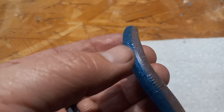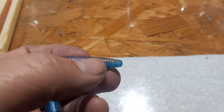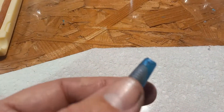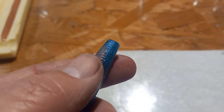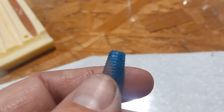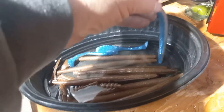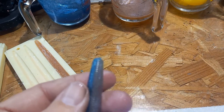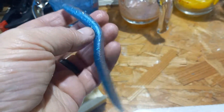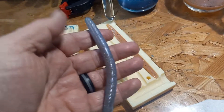This is without a laminating block, and I think this is far simpler than with the laminating block, and the results are just as good. On the end you can see the pink kind of thinned out and the blue overtook where I didn't fill it to capacity. At the tip where the sprue was, I intentionally did not pour up to that area — I wanted the blue to have a hundred percent of that area, so I pulled the pink back a little bit. Laminating two colors without the laminating plate or without trying to cram aluminum foil in there — it works great on all the molds I've done it with so far.